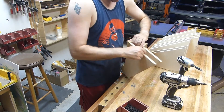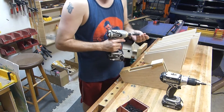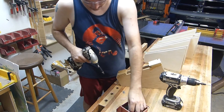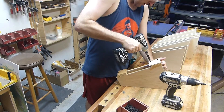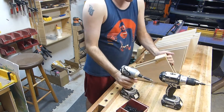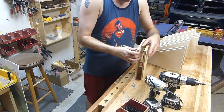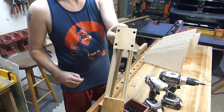Here you can see without the screws there's just a little bit of flex. Once I drive in these — I think they were one and a quarter inch number eight screws — it really stiffened the whole bracket up. After I drive in the last screw, you can see how much more solid the brackets are. I don't add any screws to the bottom section; that's just to keep the spacing right so the brackets sit level against the wall.